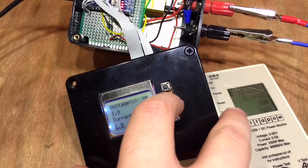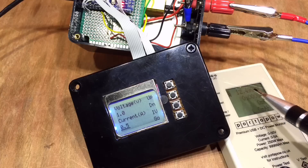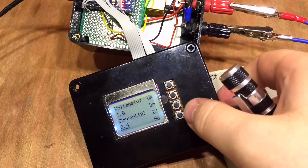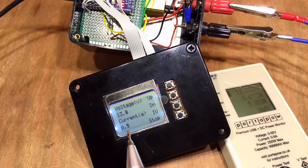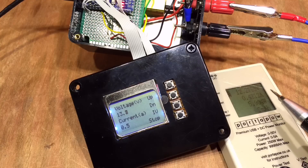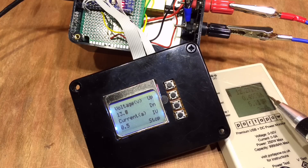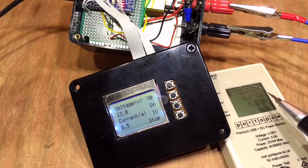Let's turn it on. First test — let's go a bit lower than one amp, let's go for half an amp. At 12.5 volts and half an amp that's going to be six watts. It took a little while to rise up to half an amp, but look at that — it is actually very close. It's going up and down a little, and I guess that's due to the speed of the Arduino calculating whether to increase or decrease the pulse width.